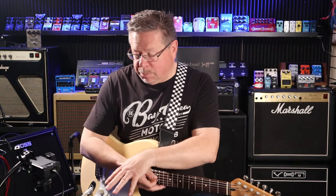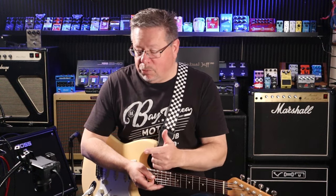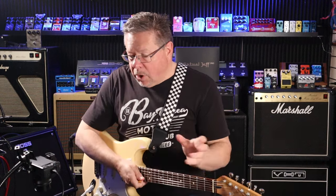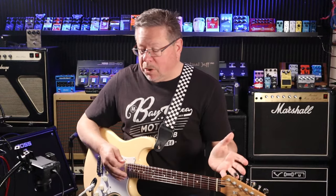Apparently the power supply that comes with it, which I didn't get, this is a pre-owned pedal, provides 9.6 volts at maybe 250 milliamp. I've struggled to get this to perform in the octave mode and the shim mode, obviously requiring some stable current and/or voltage without popping and/or farting. I managed to put a 500 milliamp supply onto it, and it's not quite as bad. In fact, the shim mode works.